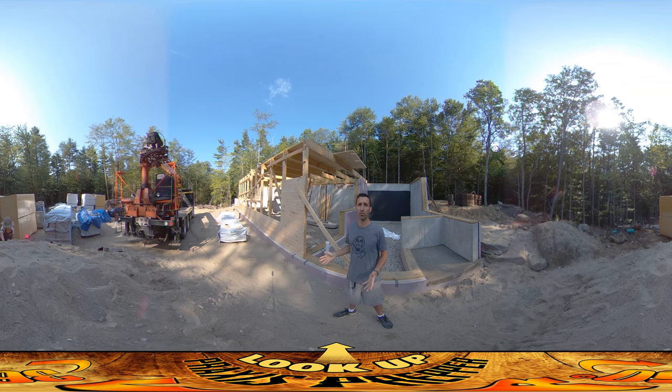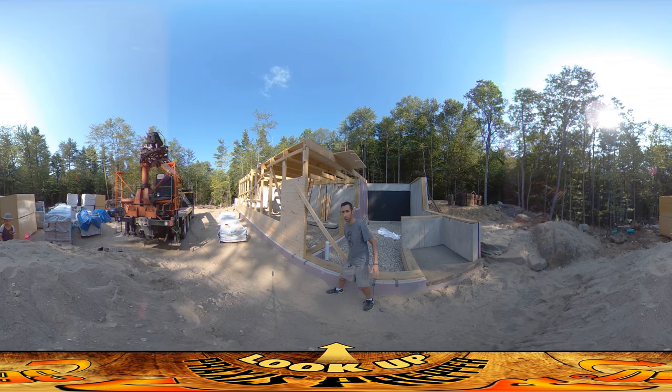For today I want to show you what I was mostly working on yesterday, which is this sheathing right here on the side of the wall. I have been doing floorboards up on top, but the structure was just a little wiggly. We have the bracing holding these vertical posts vertical, but even with the bracing there was still a little bit of a wiggle in it. I figured it might be a good idea to get some of these sheathing pieces on there, because structurally a triangle is a very strong form — that's why we do these angled braces to hold it together.